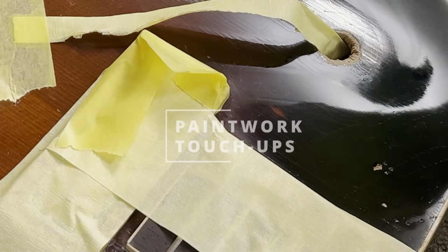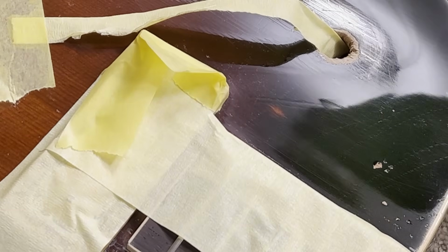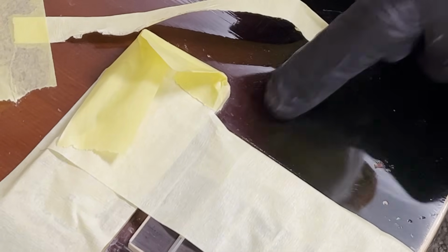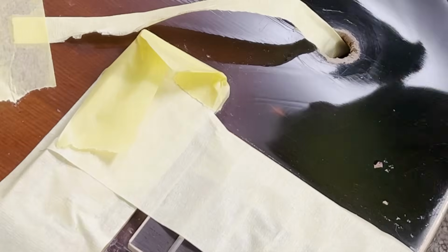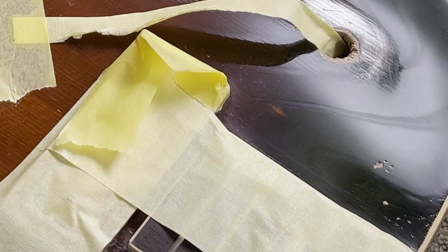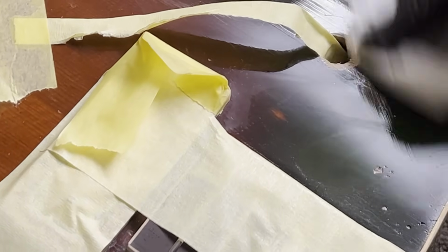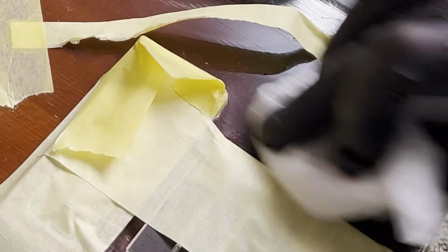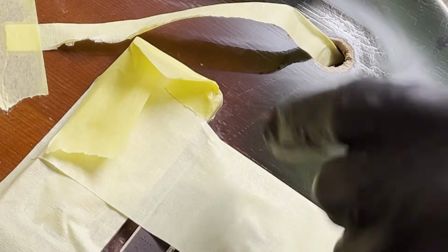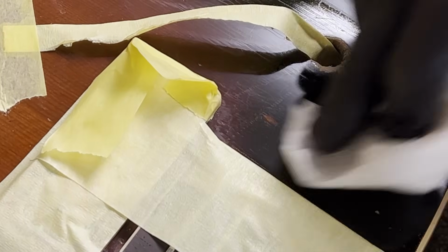It's always hard with projects like this, you know, to know where to hold it and where to fold it. And in this particular instance, you can actually still slightly see it here, but there's these pigtails that you normally associate with orbital sanding, and they were certainly not from me because I didn't do any orbital sanding around here. But basically, when trying to sand that through, because this finish is so old and thin, I ended up sanding through on this little bit, which is obviously extremely upsetting, and, you know, quiet words were had with myself.